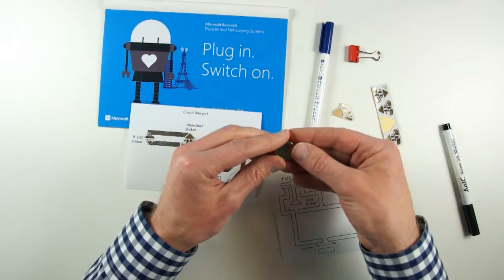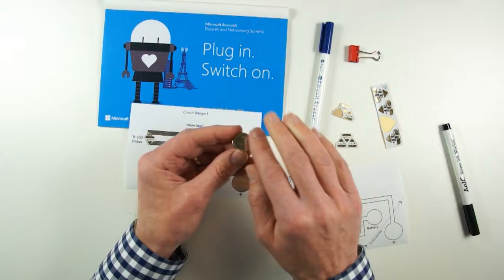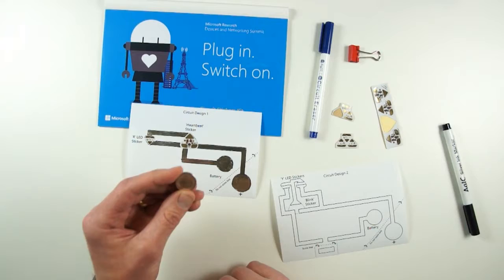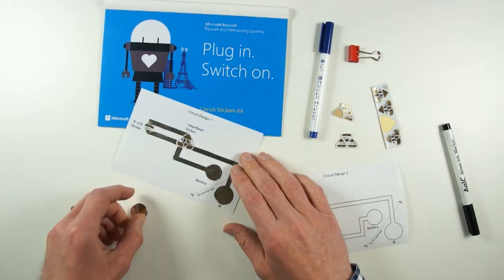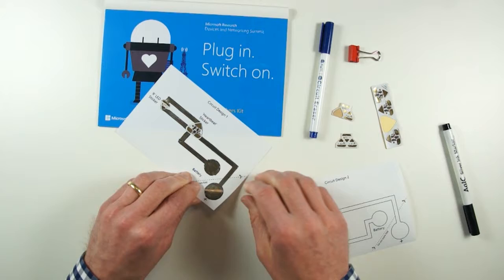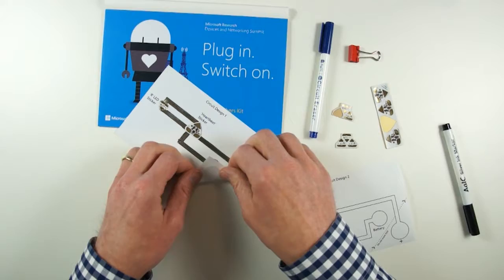Now my circuit's made, I just need to use the battery. On the back side of the battery there aren't really any markings, but if you turn it over so you've got the larger side facing you, there's quite a bit of text and there's a plus sign — that's the positive side of the battery, which must connect to the positive electrode drawn on the circuit. In order to make a battery connector we need to fold the paper over. It's important not to score it — if you really score this line you will fracture the trace here, and we want a gentle curve on that.